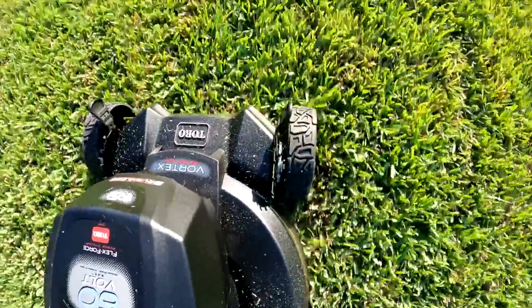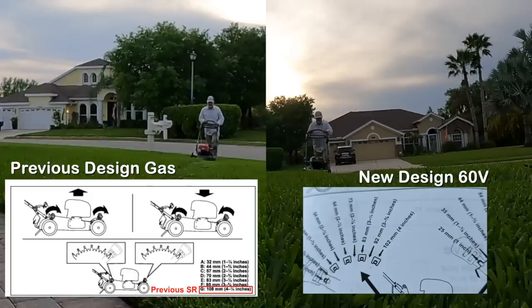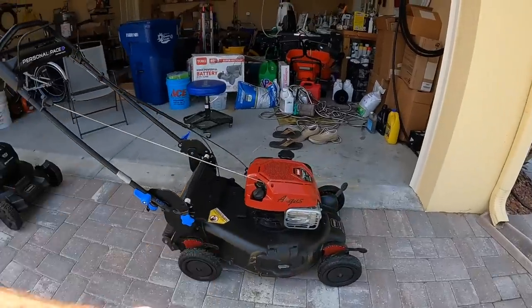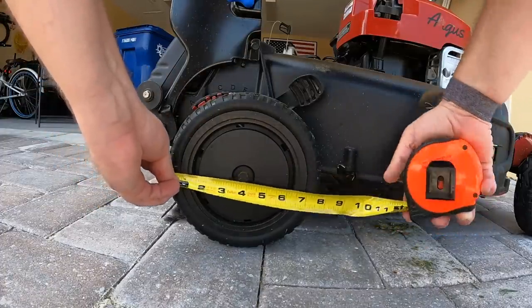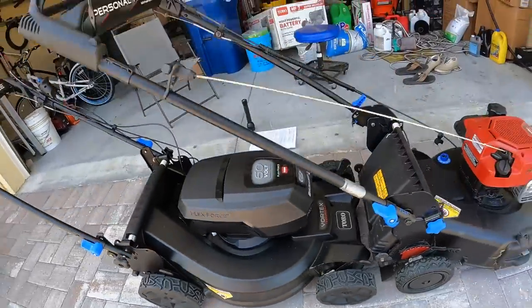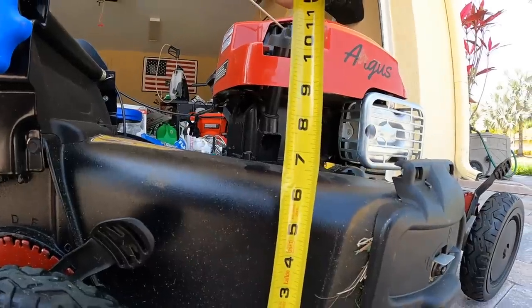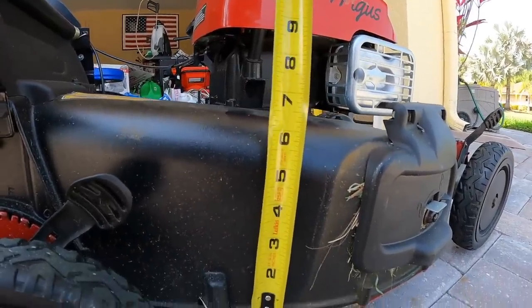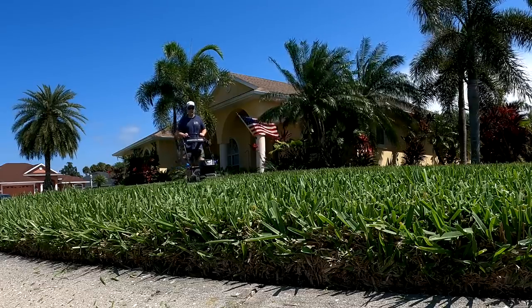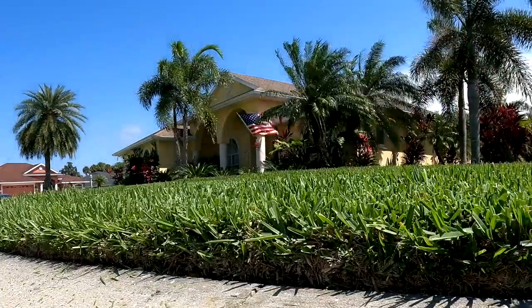Now we're talking about the blades and cutting, let's talk about the cut height, because there's something we've lost here. The old design of the Super Recycler gave a top cutting height of four and a quarter inches, but with this new configuration the manual shows a max cut height of only four inches. The wheel configuration is also different — the older version had front and back tires the same size, while the new version has smaller front tires. The deck is also a complete redesign, much deeper than the previous deck. However, I don't notice a difference in cut quality between the two — this cuts just as well as the older version.